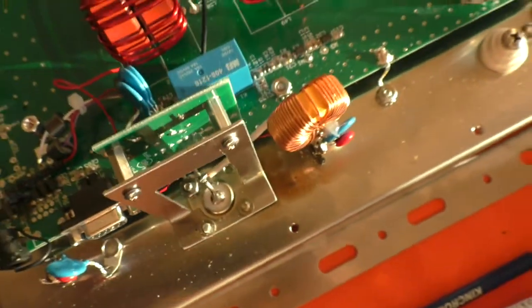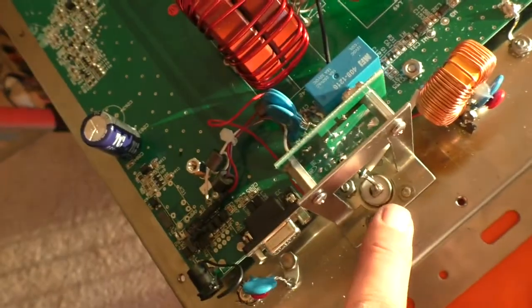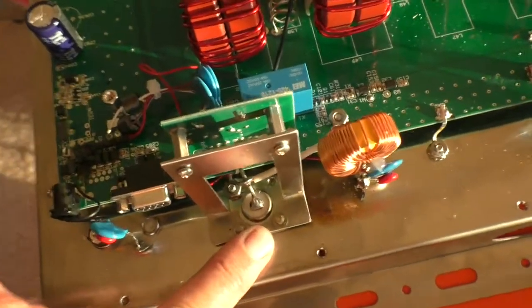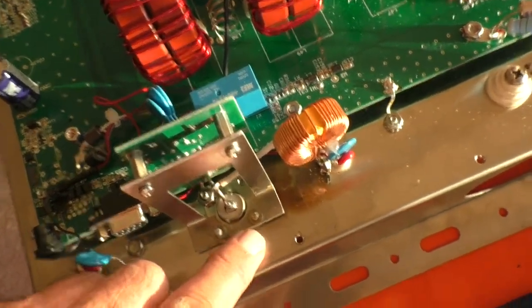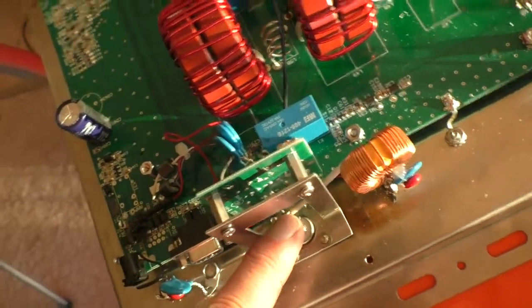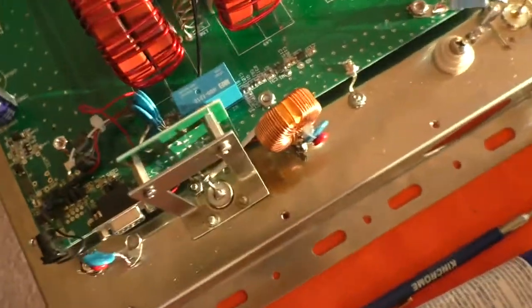Now, I know it's a 1500 watt tuner but we can't have 1500 watts here in Australia — 400 watts is our maximum. But even if I could put 1500 watts into it, what you've got to bear in mind is this is the low impedance end, the 50 ohm end. It's only going to be tuned with 20 watts, so there's not going to be any hairy voltages on here. Even with 1500 watts the peak-to-peak voltage across this point is pretty low — I did actually work it out, it's either 274 volts or 174 volts peak-to-peak. Not very much.